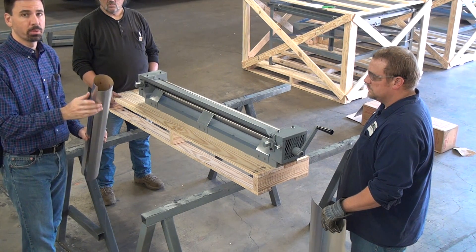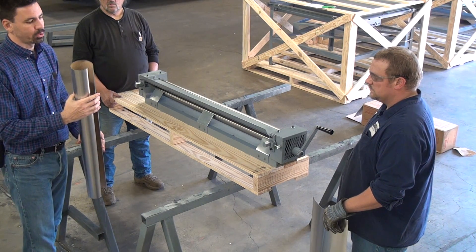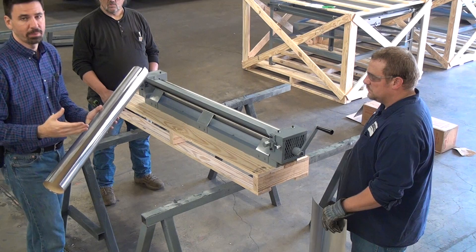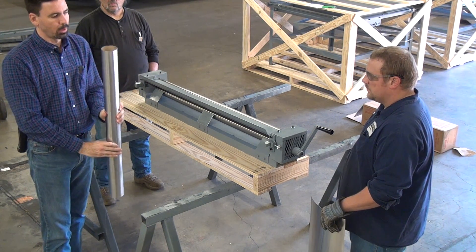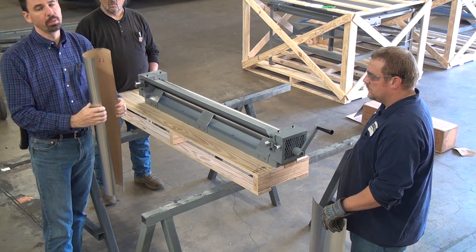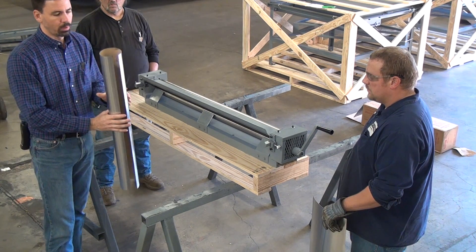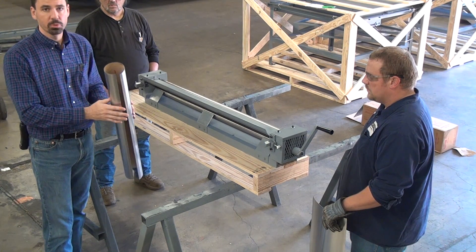You can roll stiffer materials than this, it just takes a little more effort. We can get down to about three and a half inch diameter. There's some preference with the different fabricators and installers as to how tightly you want to roll it. If you roll it completely closed with a good overlap, then opening it up to get over the insulation is kind of a bear. You leave it rolled too open and getting it to close down and band down is also a pain. So a little bit of a gap is about how we usually do it.